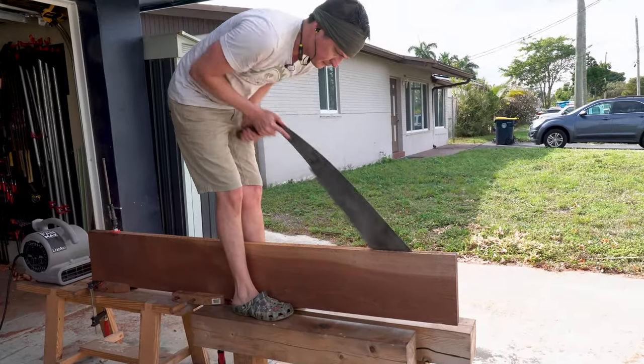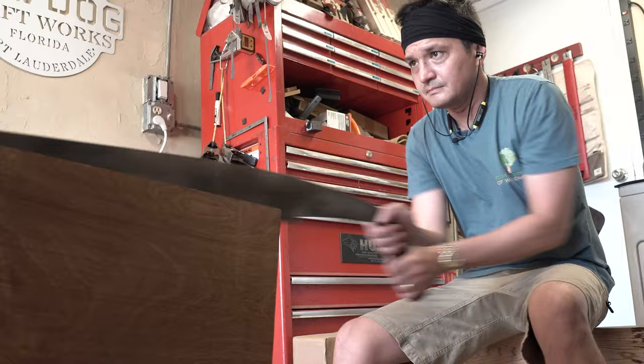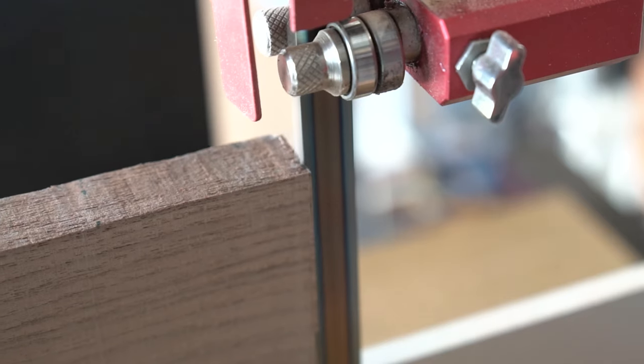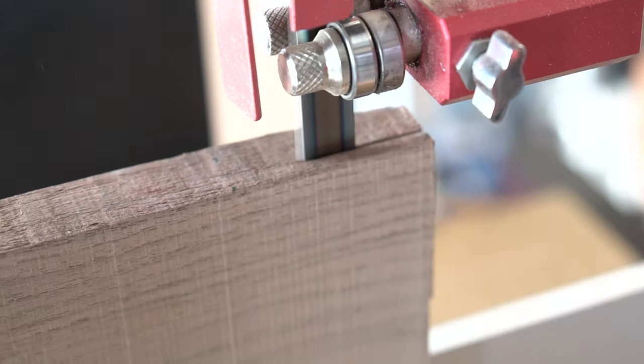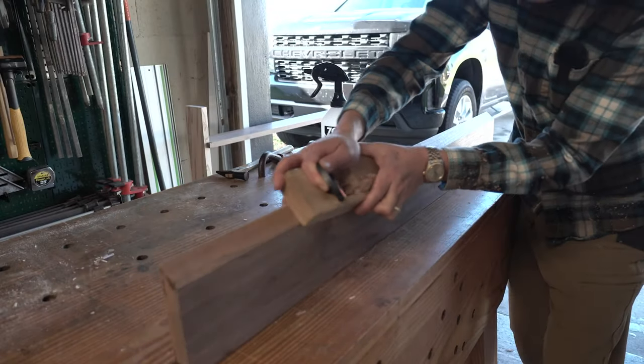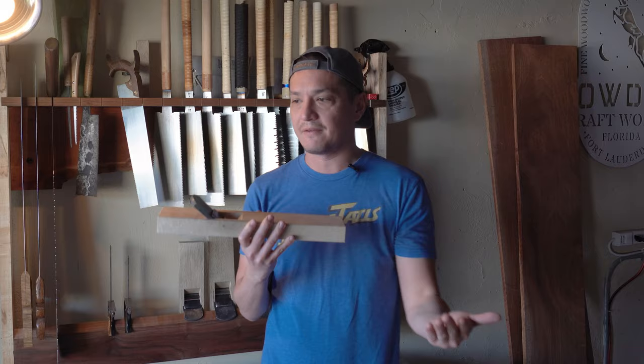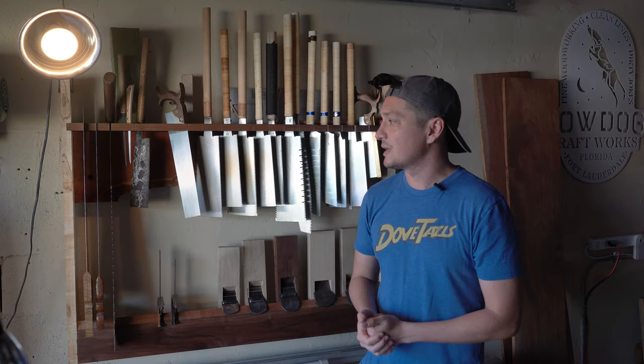As you've seen before, I've been re-sawing by hand, which is kind of insane. And it's very traditional and it's fun and cool, but I'm kind of over that. So with a bandsaw, it's going to have a fairly straight cut, but it will have a little roughage on that edge, which I can just clean up with a jointer plane. Something like this should be able to take care of all that finish work and give me a nice straight edge.